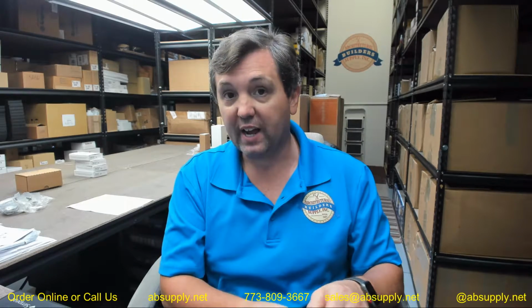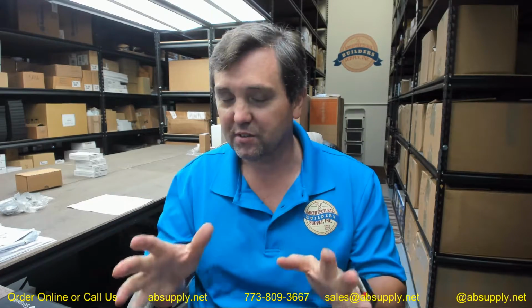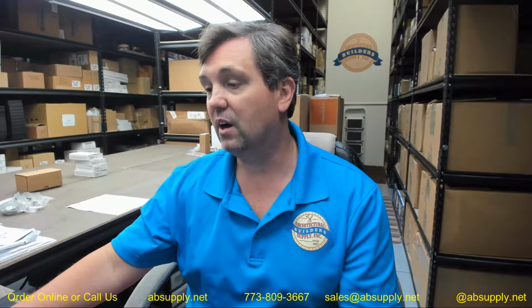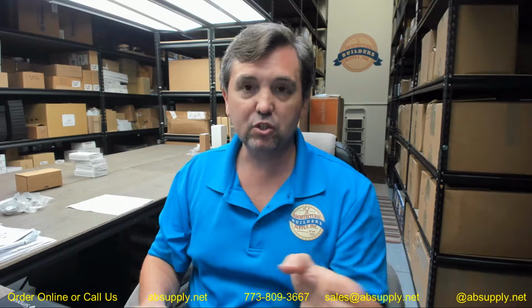The other one of note is the WS404CVX that's there. That is a 1-inch diameter unit, very small, has a projection of basically a half of an inch. And you're going to use that when you really need to have hardware as unobtrusive as possible. Really small, very elegant and petite, and gets the job done when you've got small hardware that may otherwise hit a wall or glass, in the sense of having some sort of treatment that you don't want the door to damage with projecting hardware, a wall, whatever the case might be.